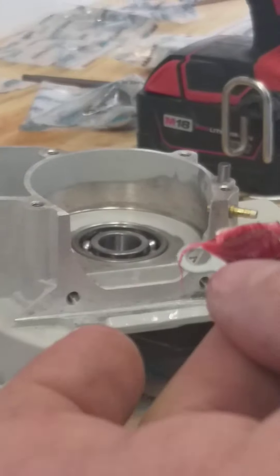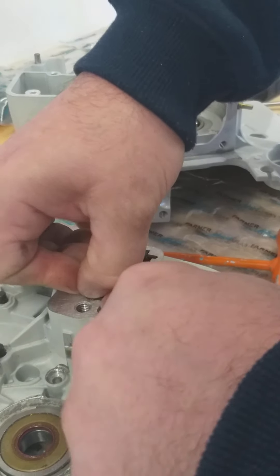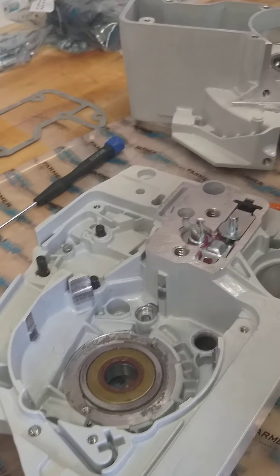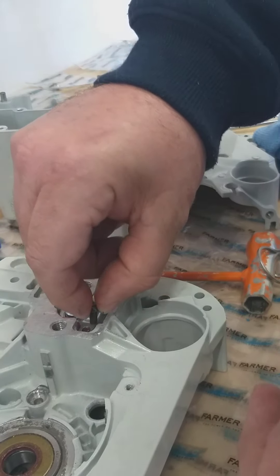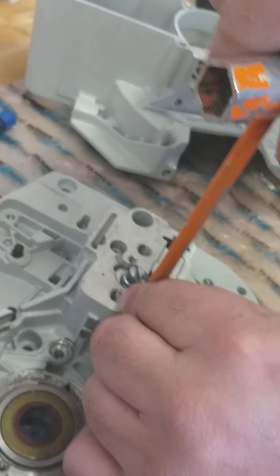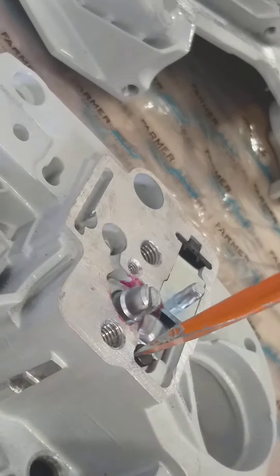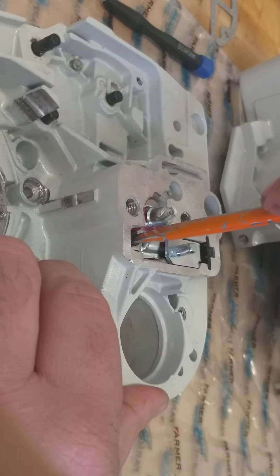We get our retention bracket and I'm going to put a little bit of grease on the inside of this, just in this groove here in the gap. All that's going to do is splooge out a little bit when we screw it down. That goes down on there like that and it is held in place. You'll find in the packet a black M4 screw by 8mm long - that just goes in the hole here. And it can go all the way down, and that'll hold that in situ.